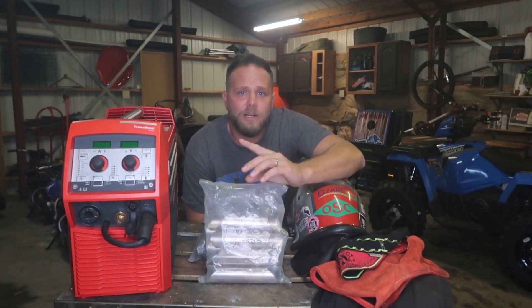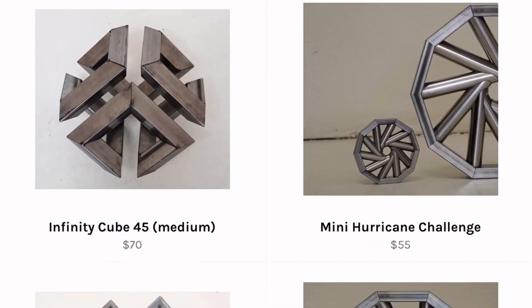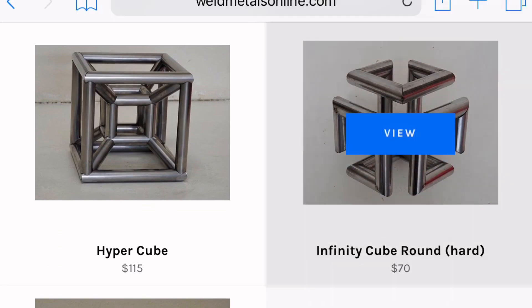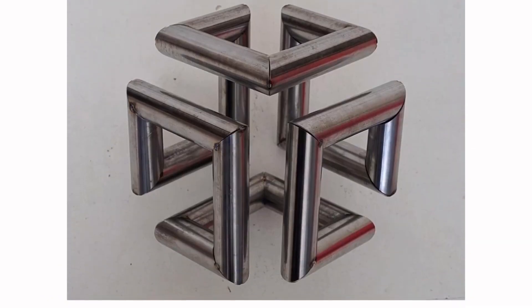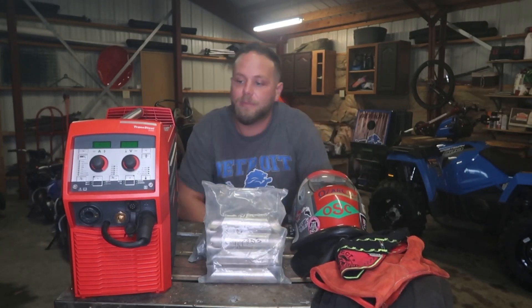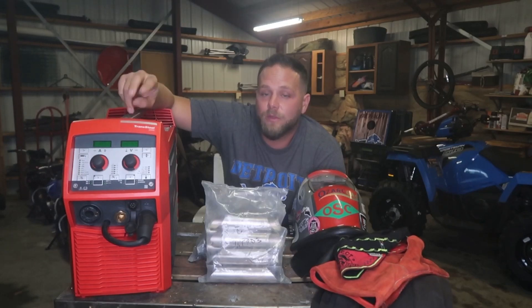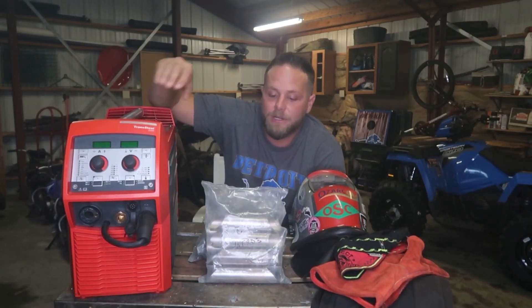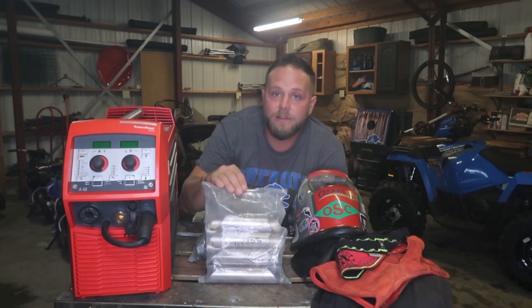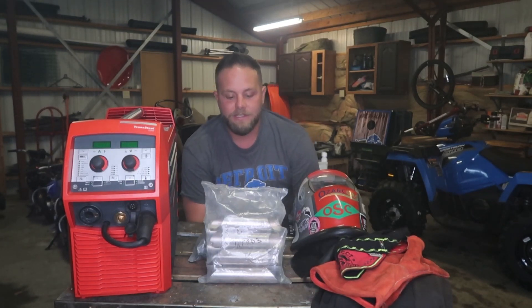You should check that video out. This one is an infinity cube — it says 'hard' on there — and I think it was like $70 or something. We're going to be brazing these up with this machine right here, called the Transteel 2200. It's a multi-process MIG/TIG/stick welder and it runs off 110 or 220 volt power. We're going to be using aluminum bronze with 100% argon, and the reason for that is I'm going to grind all these brazed welds down.